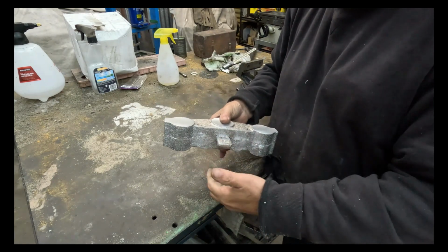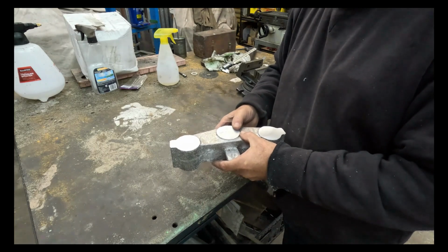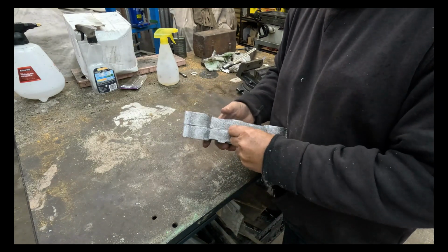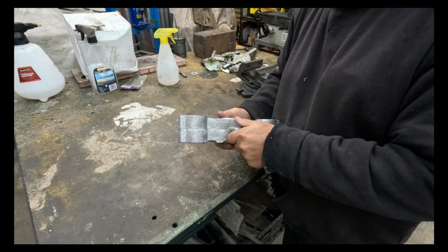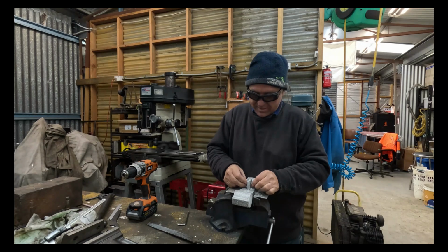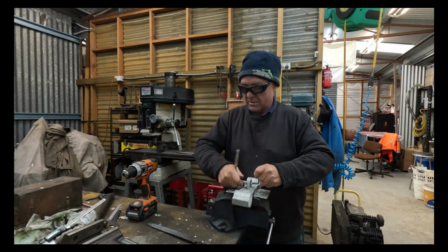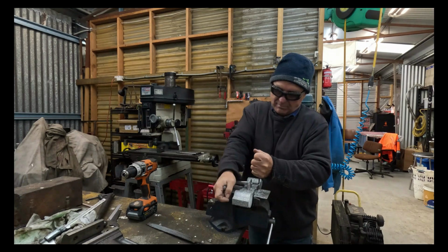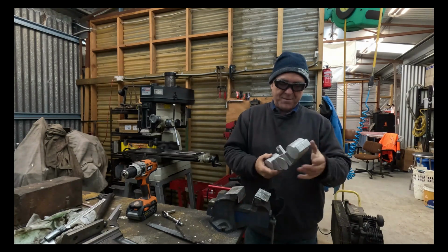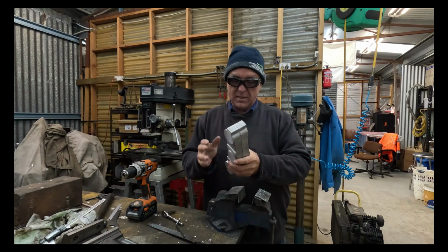So when I put it on the milling machine, I can put parallel strips underneath there, clamp, and then do all my 3 holes without moving the setup at all. So we'll have to go through. I'll have to blue and mark it out after I clamp these together, but we'll get stuck into that. So I've just drilled a hole through here, M6 socket head cap screw and nylon nut, and we'll clamp these together. And there you have it. So I will now go on to bluing these off and marking them out.